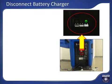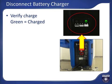Before unplugging the machine, look at the charge level indication display just left of the cord connection point at the back of the machine. If the LED is green, the batteries are fully charged and ready. If the red LED is on, the batteries are still early in their charging cycle. If the yellow light is on, the batteries are getting closer to fully charged but not there yet. You can use the machine if the yellow LED is lit, but the machine should get a full charge to the point of the green light coming back on each day to properly maintain and extend the usable life of the batteries.